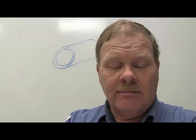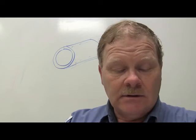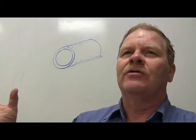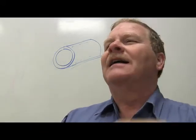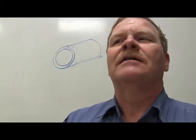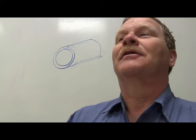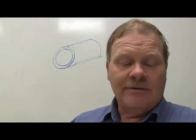A hydraulic press is being used to separate a bearing from a shaft - what should be used to cover the bearing during this operation? Put a brake drum on it. The brake drum has a hole in the middle and makes a nice shield - if something shatters during pressing, the brake drum acts like armor plate. Also think about pieces flying over and damaging the paint or windshields of expensive vehicles sitting nearby, like a Mercedes or Lincoln.